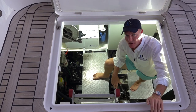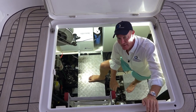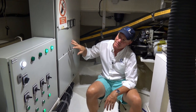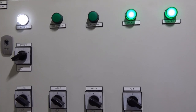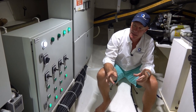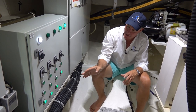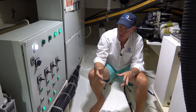We're going into the starboard engine compartment. Here on the starboard side are the shore power and generator power controls. Right now we're connected to two 50-amp shore power cords — combined they make 100 amps. The boat will run on one 50-amp cord, and you have the ability to switch between the two generators. You have auto, off, and manual switches, all set to auto because the electronic controls on the flat-screen panel at the helm let you switch between generator, shore power, combined shore power inlets — giving you huge versatility, whether it's the inverter, one or both generators, or one or two shore power cords.